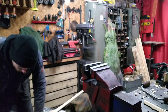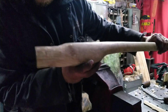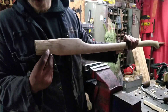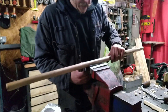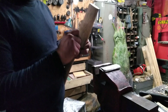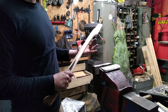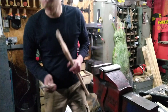The bar goes in here — there we go. See the darker patches? There's three there — one, two, three. We shade them off; that's where it's picking up inside the eye of the axe. You remove that and it makes a nice snug fit. So I'm going to use my carving knife — forged with Nick Beserman — just clean this up and dress it, go around with a sander, clean up the end where we've been knocking it, fit the wedge, then give it a good oil.